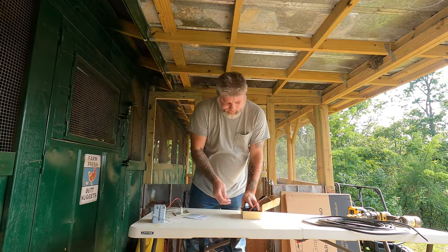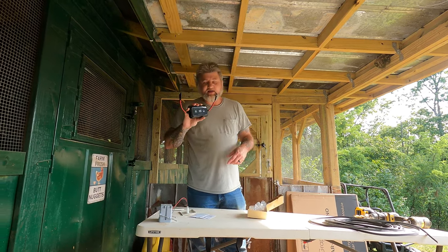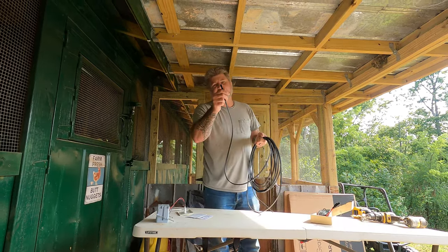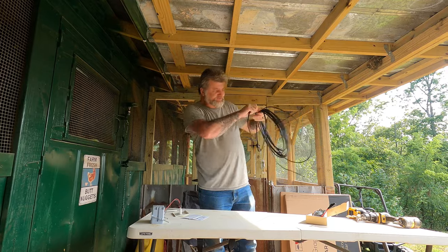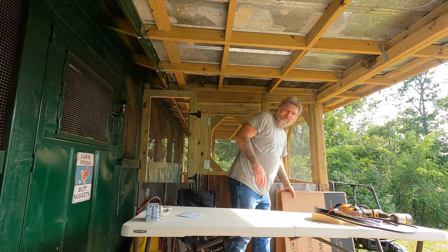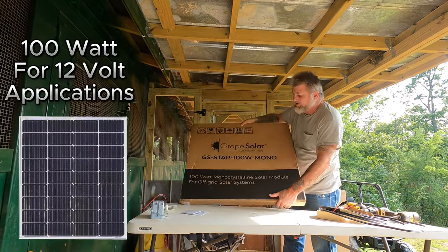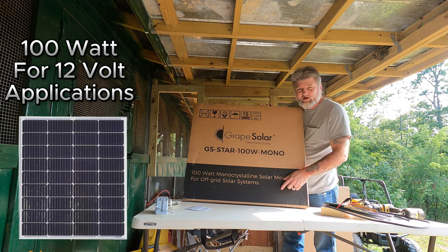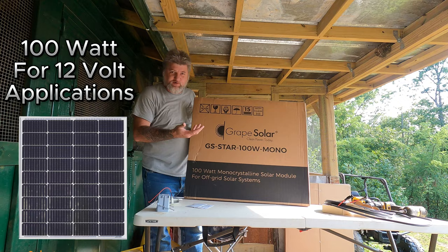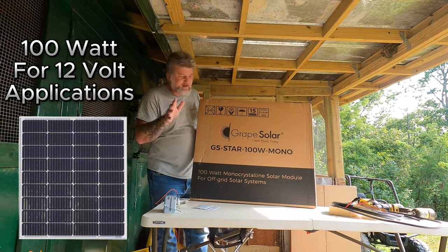It's going to be kind of a two-part video here, because not only did they send me this to try, and I've read reviews on it and this thing's supposed to be pretty awesome. It's 20 amps, and I've got 30 feet of 12 gauge wire that I'm going to use. The second part of this video is that Signature Solar sent me a couple of Grape Solar 100 watt solar panels. Basically a 12 volt panel, 100 watts, though I think they're rated at like 18 volts technically, but it'll work.